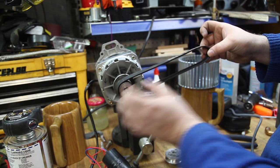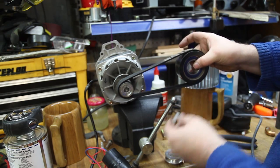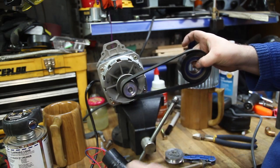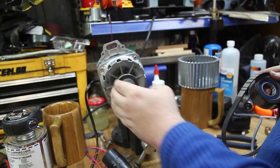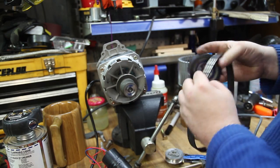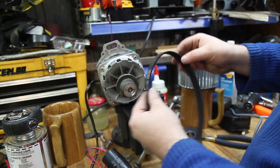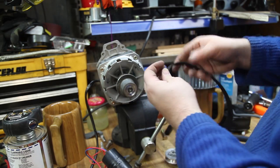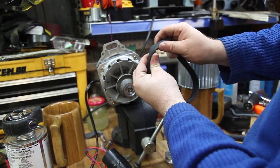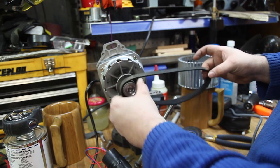Going from about two inch to about three inch. If you were to just bevel this, that'll work just fine — the flat pulley will want to find the groove and just ride up on the height of the groove; the pulley will basically ride up and center itself. But when you've got a lathe, you may as well just do it right. You might even just put a set screw in the back here.